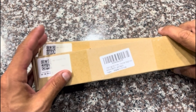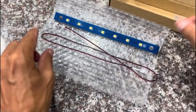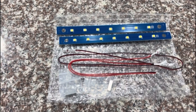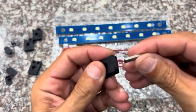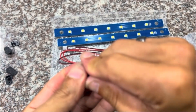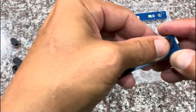First thing we're going to do is install the LED lights. From what I've seen, installing only one won't really give you the required light, especially when using the camera, so we'll be installing two. The lights come with harnesses and magnets to mount the LED bars, but we do need to print the mounts and board covers. Once printed, pop the magnets into the openings of each mount — they slide in with a little force, and if they're tight, add some heat with a heat gun or lighter to soften the filament.